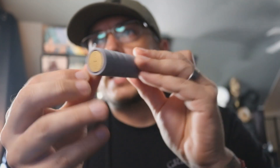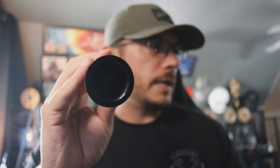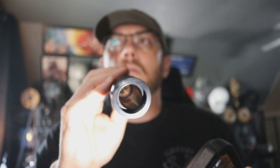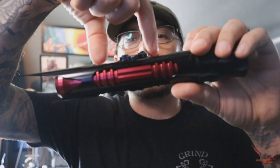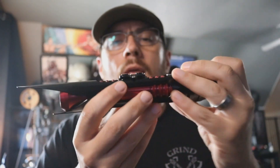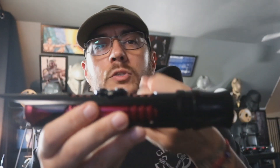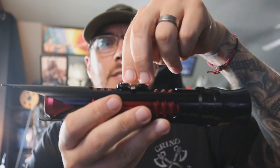We have this Smuggler's Outpost Switch Pixel PCB set here — this is the female PCB, and it makes contact with a 14-pin PCB in there. There's a chassis piece in here that goes from here to here, holding that 14-pin PCB, all the wiring for your switches, and your NeoPixel holder. That is held in place by these two switches — there are two holes in the actual chassis that line up with the two switches, and when these switches are pressed into the chassis piece, everything is locked in.